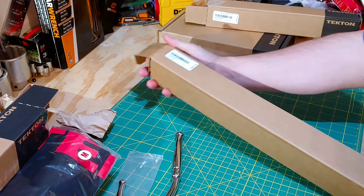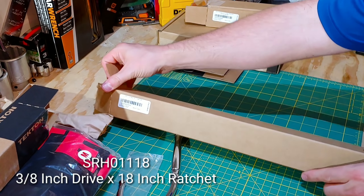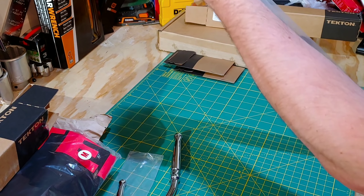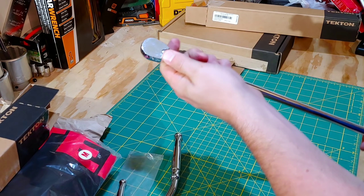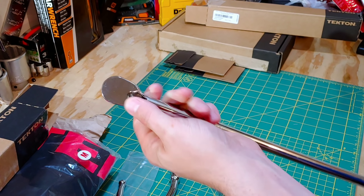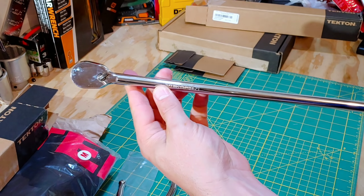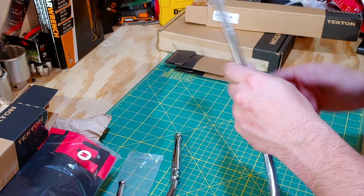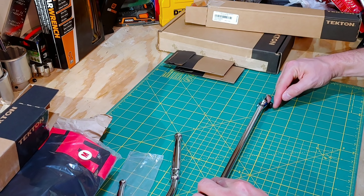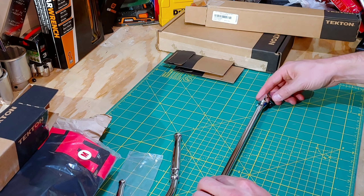This is another neat one — I don't have one quite this long. This is a 3/8 inch drive 18-inch ratchet. It's a non-flex and this is one of the longest 3/8 inch drive ratchets that Tekton makes. It's got a really slim head ratchet — a very small pear head. You can see it's just a little bit bigger than my thumb. We can throw it down on the mat and measure it — that is actually 18 inches right on the beginning of the anvil drive, and you can see it's actually almost 18 and 3/4 of an inch.